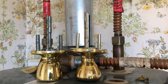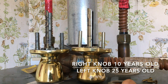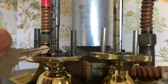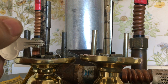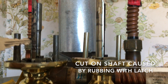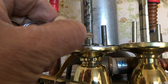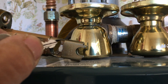This is an example of a worn out doorknob. Both are made by the Kwikset company. The one on the right is about 10 years old and the one on the left is about 25 years old. If you look at the one on the left, I'm pointing with a key — you notice the metal is worn out enough that there is a shallow depression, like it's been scalloped, cutout. That's from rubbing metal against metal between this part and the latch. Eventually you get the metal wearing out like that — the metal literally gets rubbed off. That's what happens over 25 years of time.